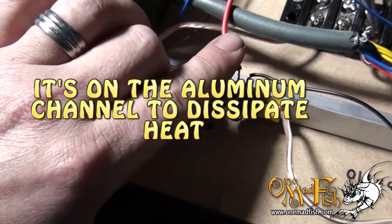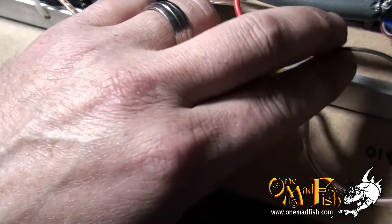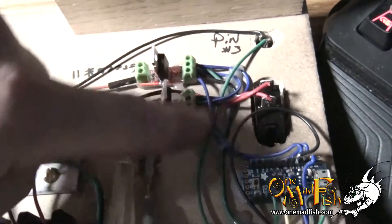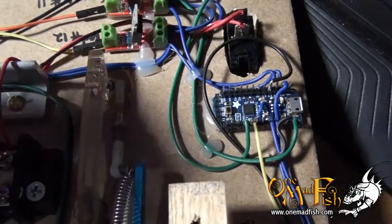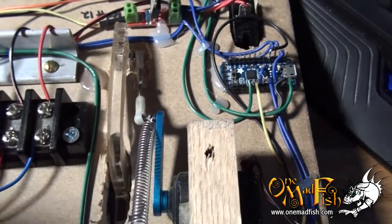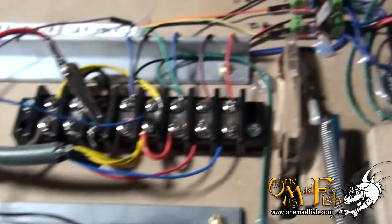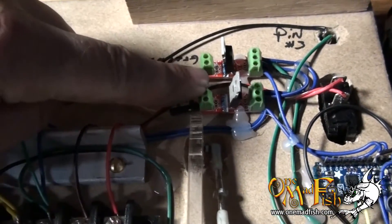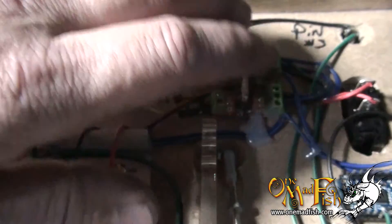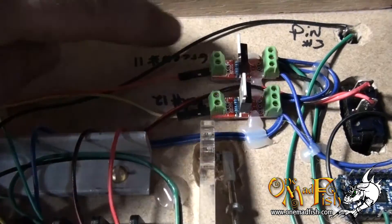I have it switched, with the gate wire hooked up to the Arduino. Rocker switch to turn it all on. Momentary switch hooked up to the Arduino to give it a trigger. It's all set on delays — a simple little program that switches a pin high and sends out 5 volts, which activates one of the MOSFETs. I have some MOSFET boards back here, which I'm going to replace with just regular MOSFETs. These two are currently controlling LEDs — one for green, one for red.